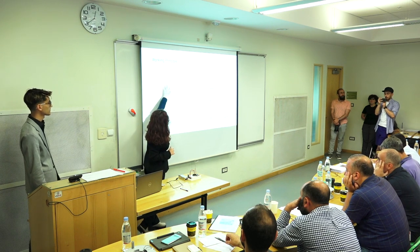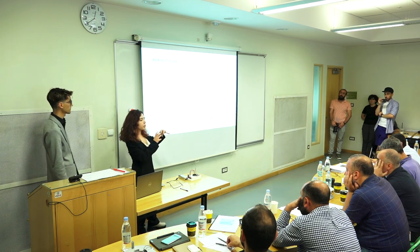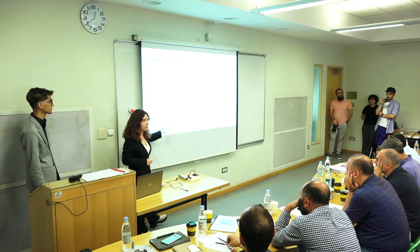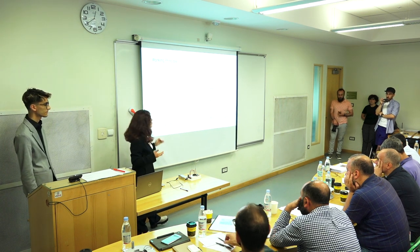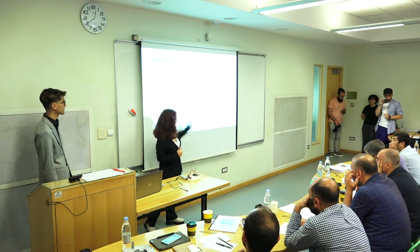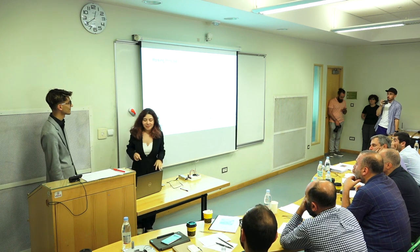And because this is a magnet and this is a metal, they would be attached to each other. So after this movement happens, we would no longer need power supply for the coil. The pen will retain its position, and the same, we would just change the polarity of the supplied power, and the pen would go downwards. I mixed up the directions, but you get the idea.